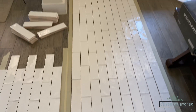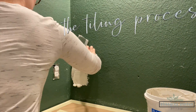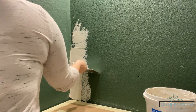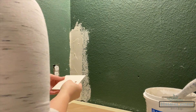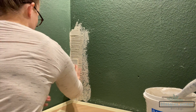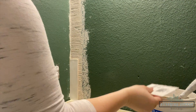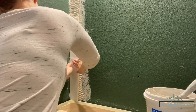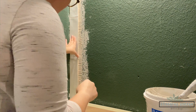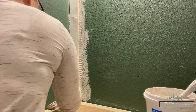I'm going to do two full tiles high and all the way to the ceiling on this side. To start tiling, take your tile adhesive, put it on a putty knife, and smear it all over the wall. Once you have a nice thick layer, use your notched trowel to make horizontal lines for the tile to attach to. With individual tiles, press each one firmly into the adhesive and wiggle it around a little to get a good suction. I started my tile pattern in a vertical upward row.